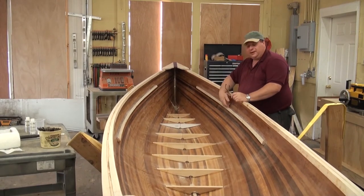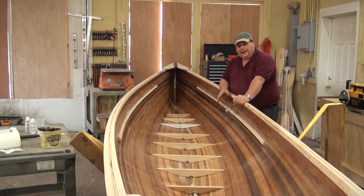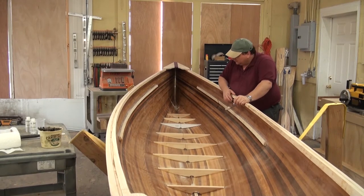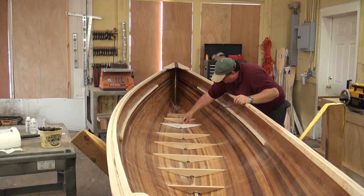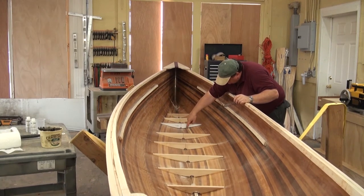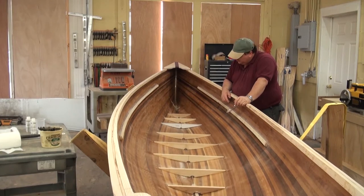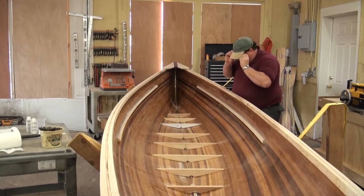The other thing is this boat has fiberglass on the inside. When you're working on a CAD system it's the perfect world, but there's only the thickness you tell it is there. I can tell by looking at this — it rocks a little because there's nothing at the bottom grabbing it. If I go back to the sander and take just about halfway up on either side and bend that curve, maybe a 32nd up to a 16th of an inch, this will start to drop right in. That's exactly what I'm going to do.